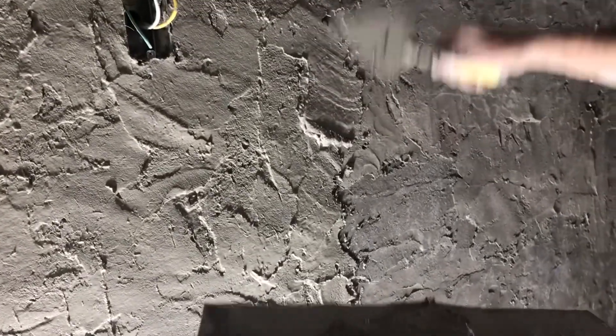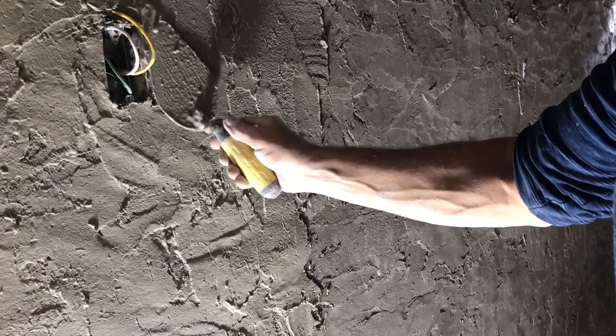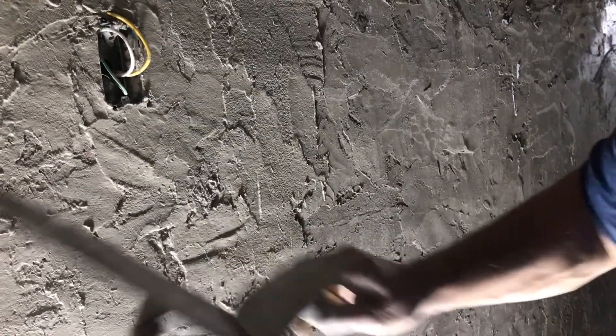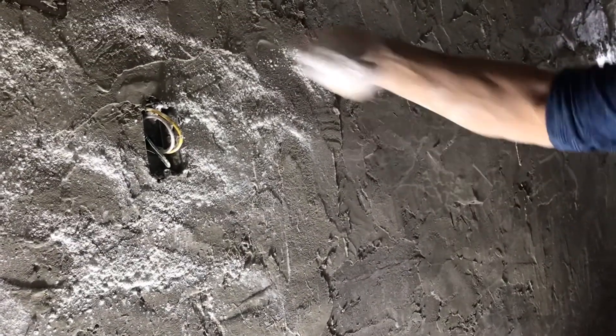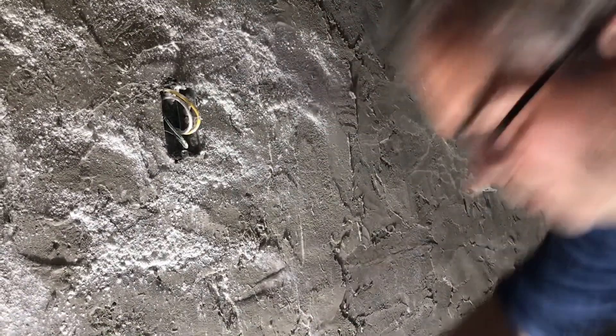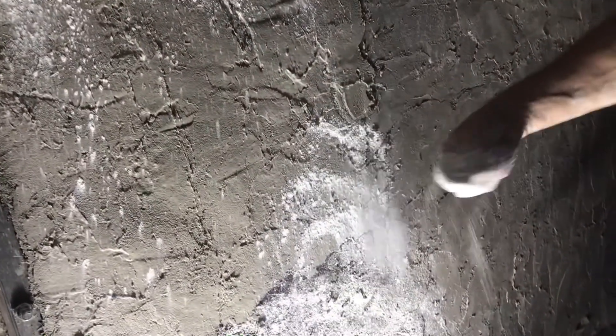I've done another section just to show you — stand far enough off the ground. I put the surface on; it's not perfect. I have an electrical outlet here so I make sure it's nice and tight. Here I'm going to start with white Portland, and notice the white Portland is completely dry, so it's sucking up the extra moisture. The mix on the wall is not super dry but it is sticky and wet, so it does its job.